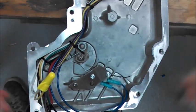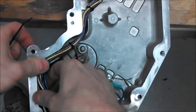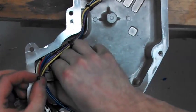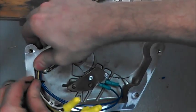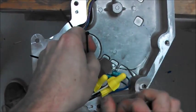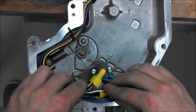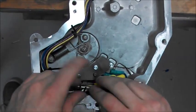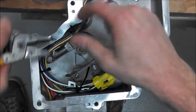I recognize this is easier to do on a bench, but it is very important that you take special care in making sure that all this is installed properly so that you can provide your customer with a good working piece of equipment. Just tuck that down in there, then take these final connections and tie those down and get them out of the way, taking care that none of these two connectors here become unplugged. Make that final zip tie and clean up the installation a little bit.